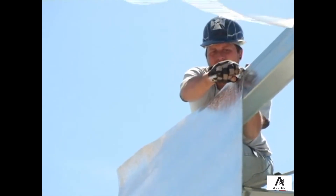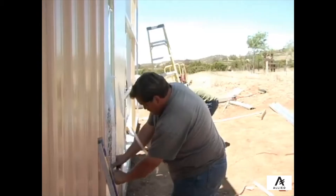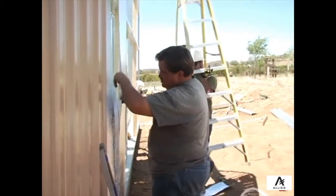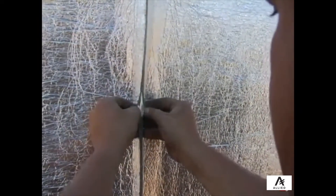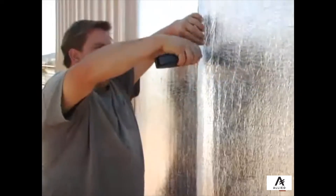In this building, we are using foam foil insulation, which requires overlapping the individual sheets by approximately one to two inches. Then the flanges are folded back using the self-adhesives, bringing the two edges together, and then a staple is placed approximately every 12 inches along the length of the insulation.